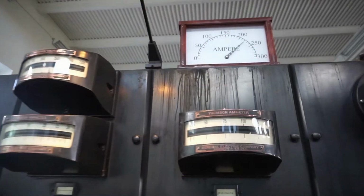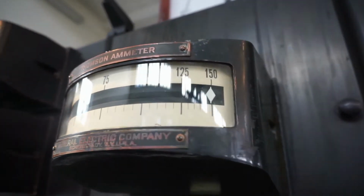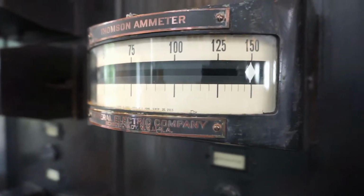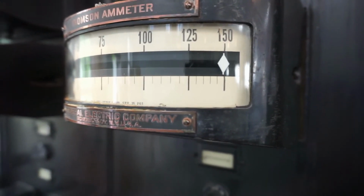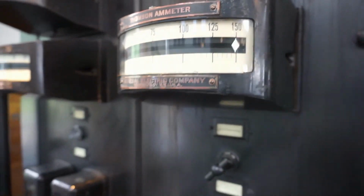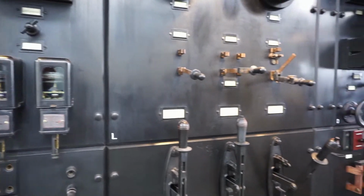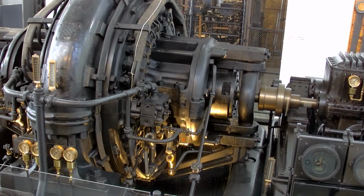We are now waiting for the internal oil pump in the transmission unit to handle the lubrication, and we can stop the auxiliary oil pump. We are also waiting for the motor to rev up and for the motor current to go down to 100 amps.